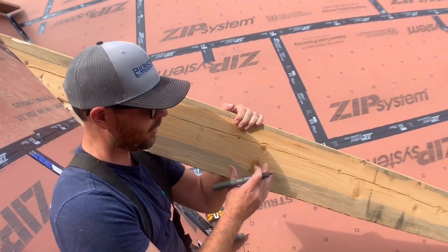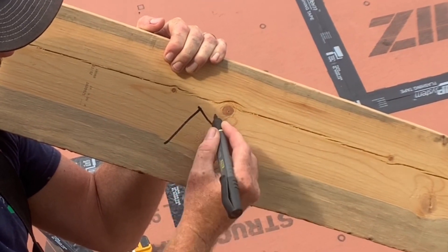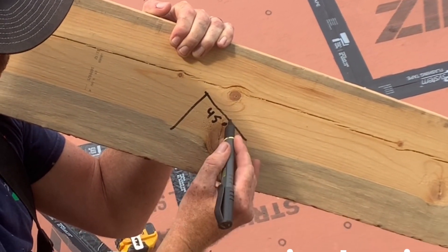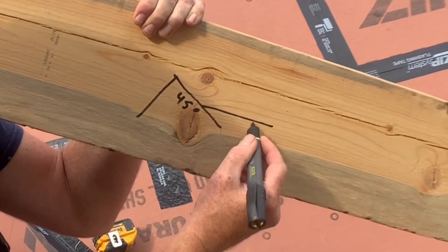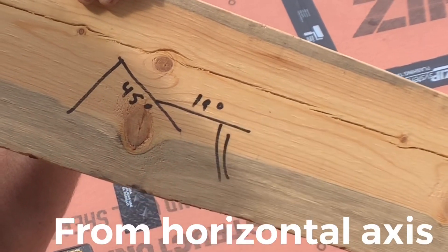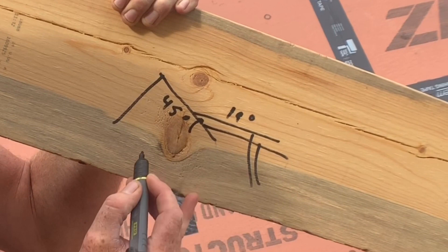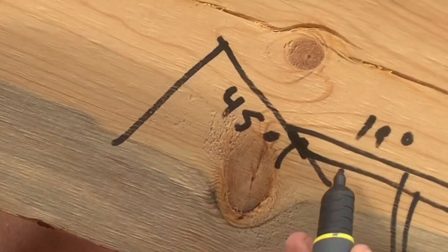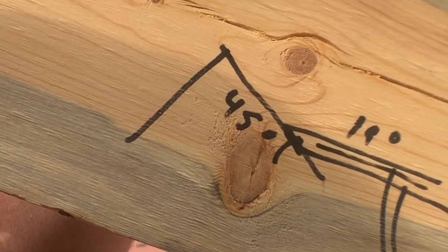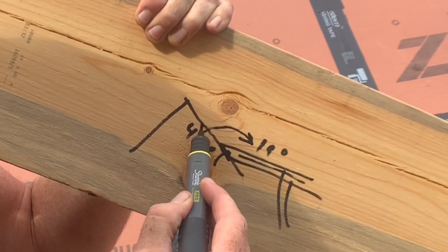Here on my drawing pad — I know that the roof we're building on top of is a 45-degree pitch, a 12/12, and the roof coming off over our porch I want to be a 4/12 pitch, which is 19 degrees. What we're figuring is this cut right here — this angle where the rafter lays over the roof. The simple and easy way to do this is to add these two pitches together.